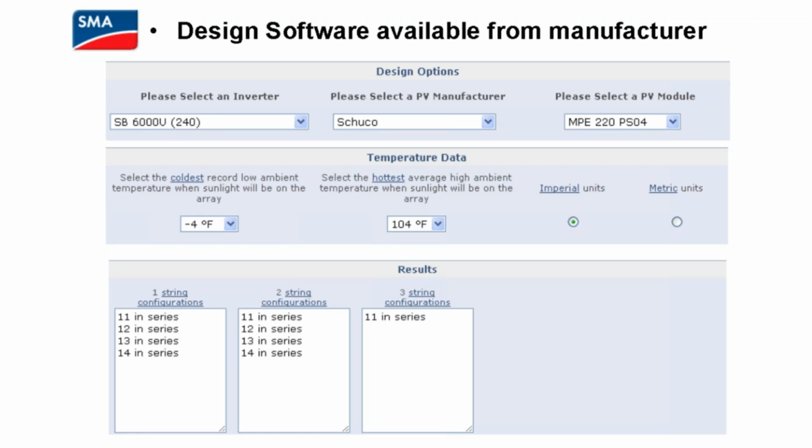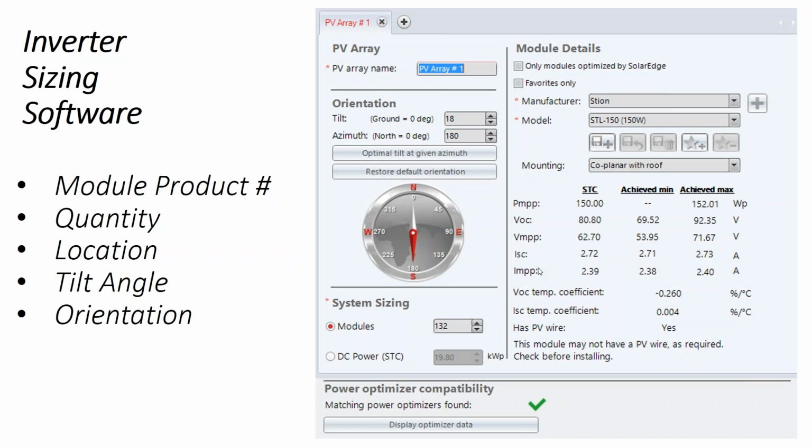And so when you do have shade on your array and it's a well-designed array, it's a very temporary shadow. And so we don't need module level granularity. Circuit level granularity is good enough, in my opinion. Now that's not true for all job sites.